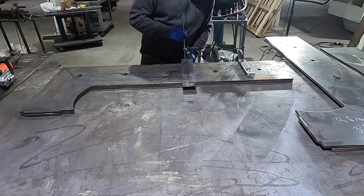I gotta drill and tap holes in that. Then I'll drill and tap holes right here, three of them. And this will give me the adjustment this way so I can press in with set screws. And then this is actually backed off a little bit to about there. And I'll drill holes with set screws in there so I can also push down on that, so I have adjustment this way and this way with it.